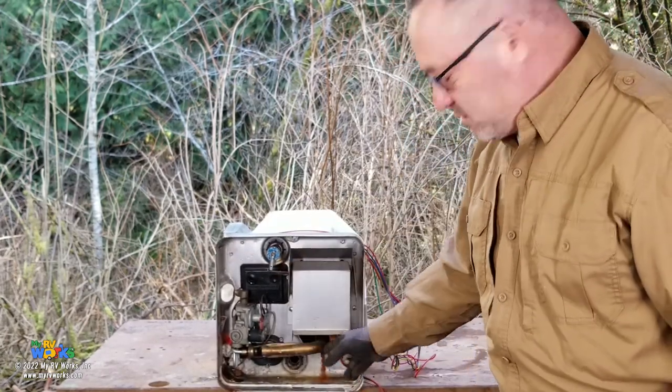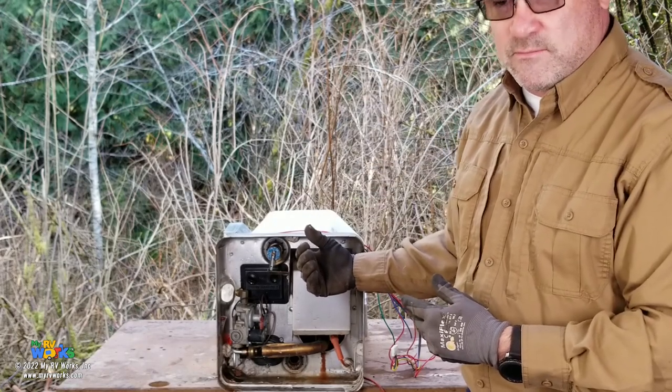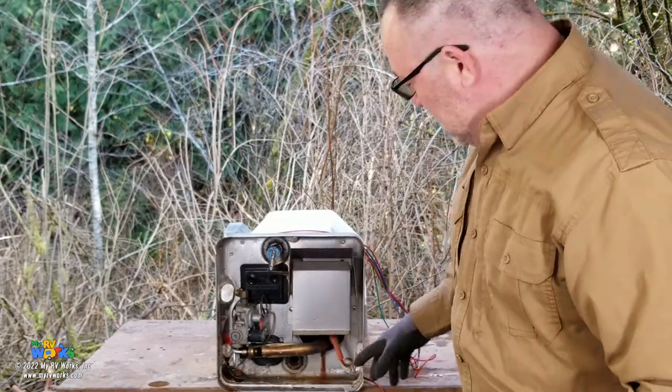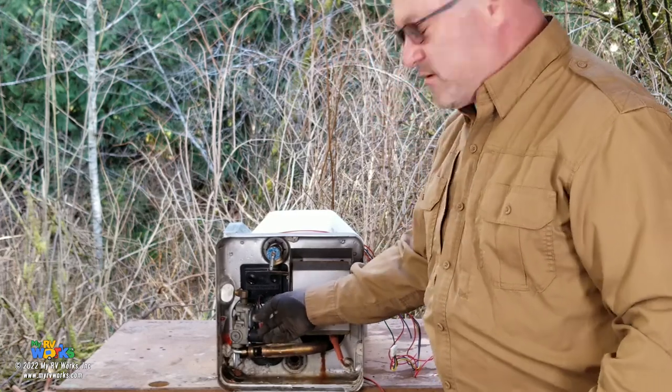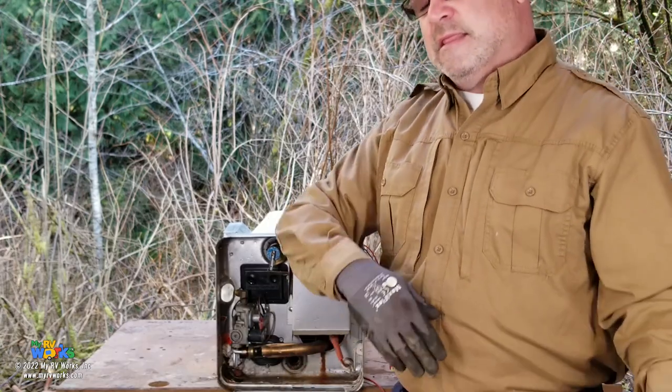Electrode wire comes down here to our igniter. We talked about the gap and how that knows to rectify its signal of 0.3 microamps. And here we have our brown wire coming over here to energize our redundant solenoids. We showed you the solenoids in the next video we're going to do.